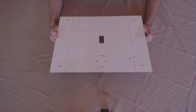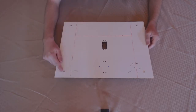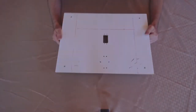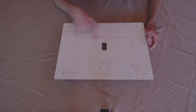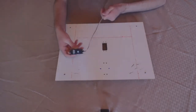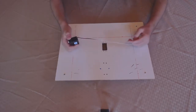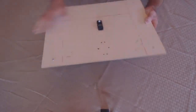The first step is we're going to take the board, which is used to hold the robot. This is just a normal particle board. It has four holes screwed in the corners for little stands to keep the board elevated. If you make your own board, make sure you have a square cutout big enough for a Parallax servo motor as well as the screw holes to hold it. We're going to take one of the black Parallax servo motors in our kit. This one is labeled A. If you're doing your own kit, make sure you put these labels on yourselves.